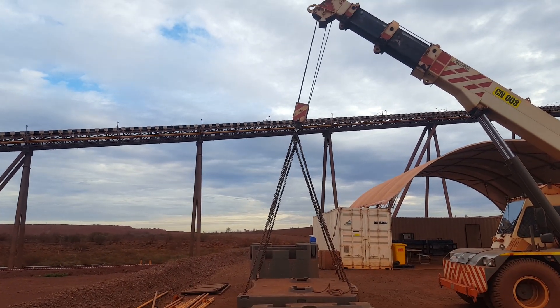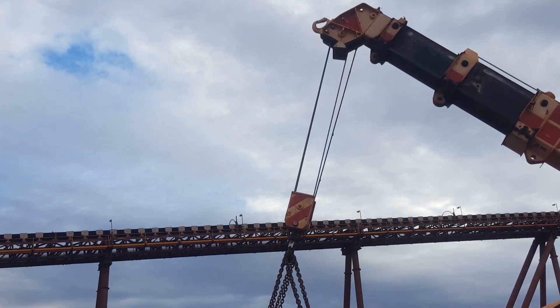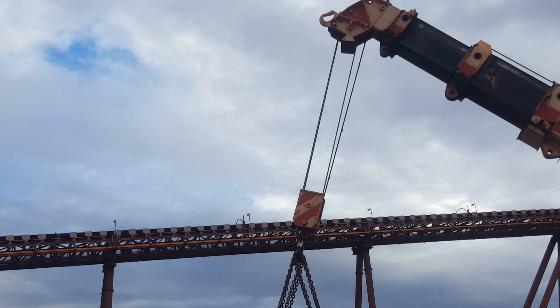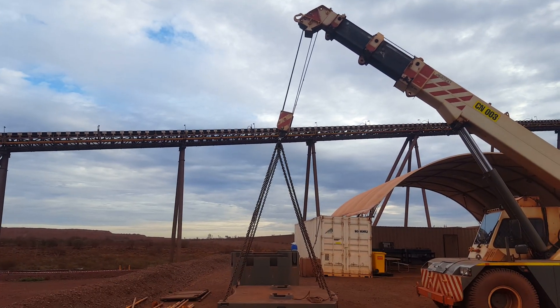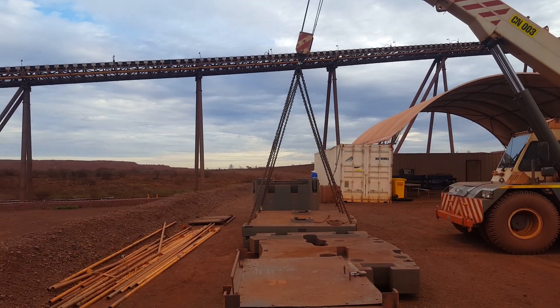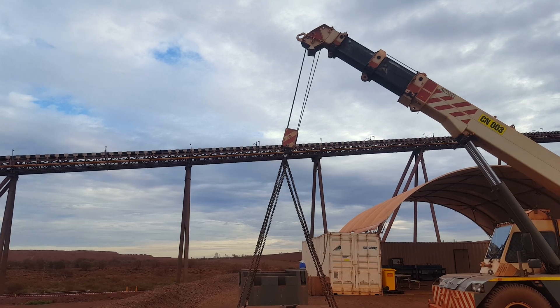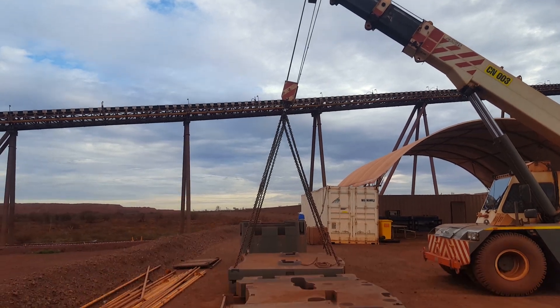On the next video I'll show the example of how you want it. You want those wires from the hook straight up and down, straight underneath the boom. And we check this — it's always 90 degrees from the crane, side on to the crane boom, not the load. The crane boom. Always go 90 degrees from the crane boom, not the load.